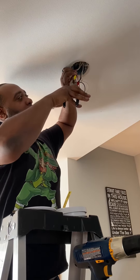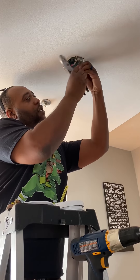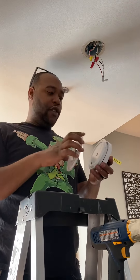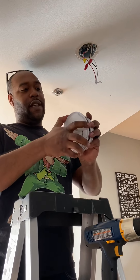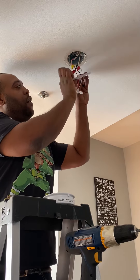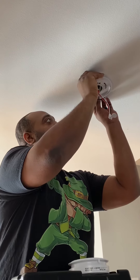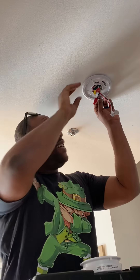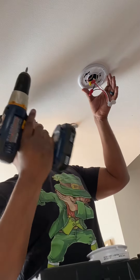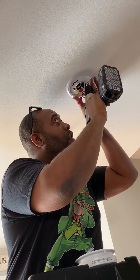Here comes the second and third cap — including a yellow one. With this setup, I have a black wire, a red wire, and a white wire. The new smoke detector also has a white wire and a black wire, but they swapped their red for yellow. So in case you're putting one on and it doesn't have that red wire, nine out of ten it's going to be that yellow wire. If you have any questions, make sure you hire a professional electrician. I'm going to go ahead and pop this last cap off, disconnect all the old cords — see, that came right off easily. The wires are twisted — I'm just going to pop the new ones on; it'll take 30 seconds.